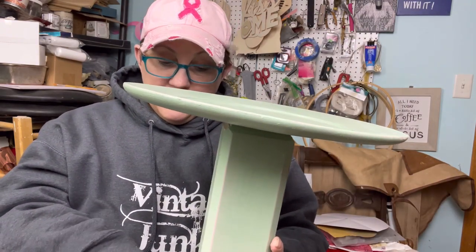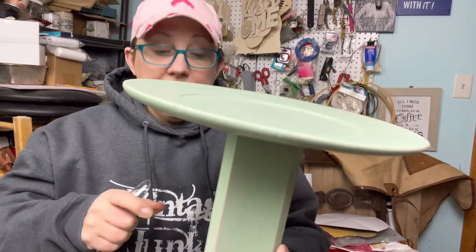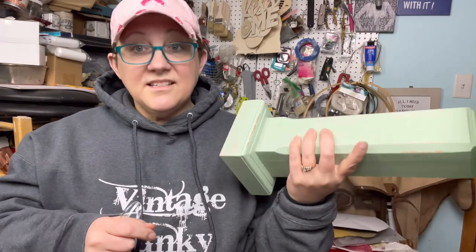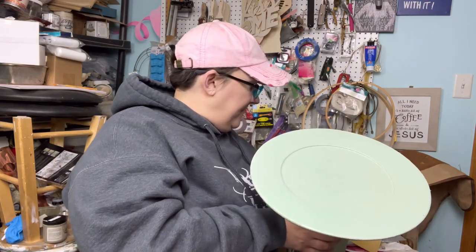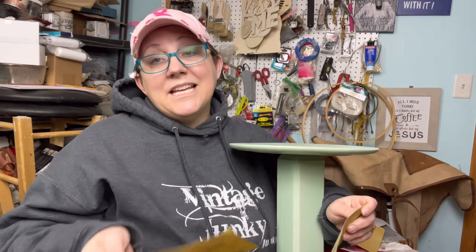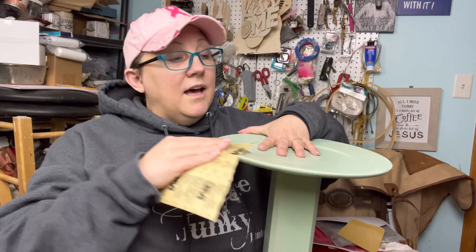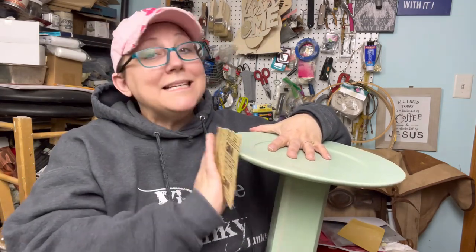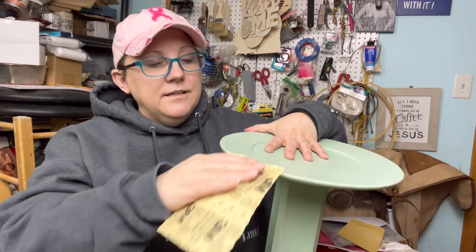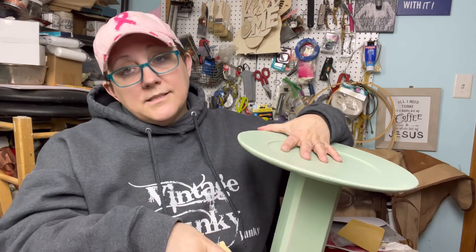That's why I tell people all the time: you will not — I even prepped this, I prepped the surface, and it still came off. So I ain't buying all-in-one paints. Until you get me a high-tech bonding primer in an all-in-one, I ain't buying it. I'm going to sand real quick — just a super light touch — and that's to feather in and get rid of the last of the wax.